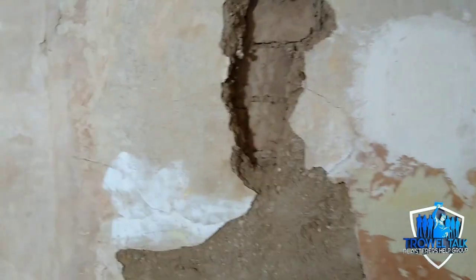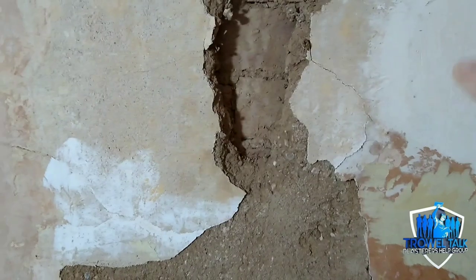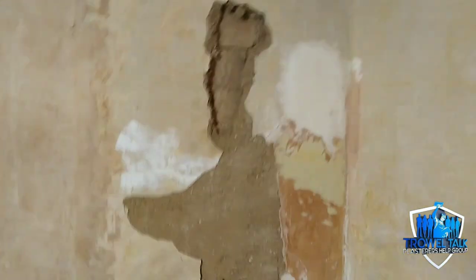So that's how you recognize blown plaster: tap the wall and you'll hear a difference in pitch, you can try compressing the plaster, or remove some of it as I've just shown. If you're a homeowner with an older property, it's always best to get a qualified plasterer in to assess the walls before you start taking a shovel to them.